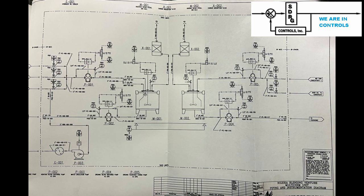The customer worked with us to develop several working models of their desired equipment. The equipment consisted of a skid with electromechanical equipment and an electronic control panel. The system required storing recipes, then recalling them for measuring ingredients and production at the job site. Ingredients were drawn from containers at the customer's job site, mixed with an agitator, and delivered to the customer. The customer wrote up the specification and drew up diagrams, including component specifications, operating details, parts lists, and a process and instrument diagram. After the prototype, one of the first systems was destined for Africa, as it eliminated the need for many custom batches and shipping containers, since many products were custom blends of the same raw ingredients.